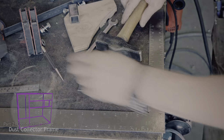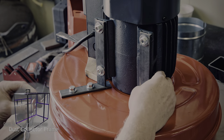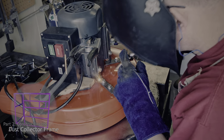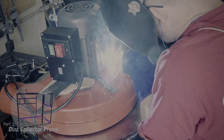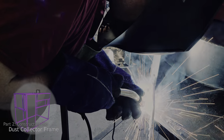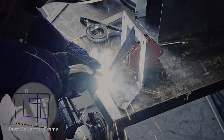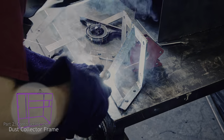My somewhat simplistic idea to making the frame is to screw in the individual pieces and then just weld them together. To make it easier to fit the screws, I use drill bits with a slightly larger diameter. However, for this to be really of any benefit, I should have assured that I centered the screws on the holes. As I don't want to damage the finish on the blower housing, I am just placing a couple of tack welds before taking the frame off and welding it together properly. The cross brace from angle iron is hopefully strong enough to stay upright under the weight of the blower which is surprisingly heavy. As the impeller is made from steel, perhaps it is not so surprising after all.